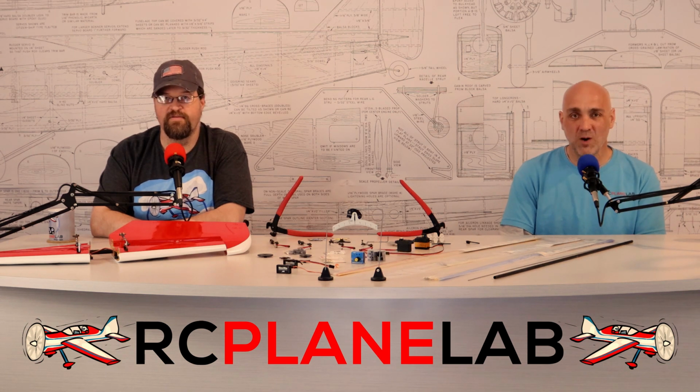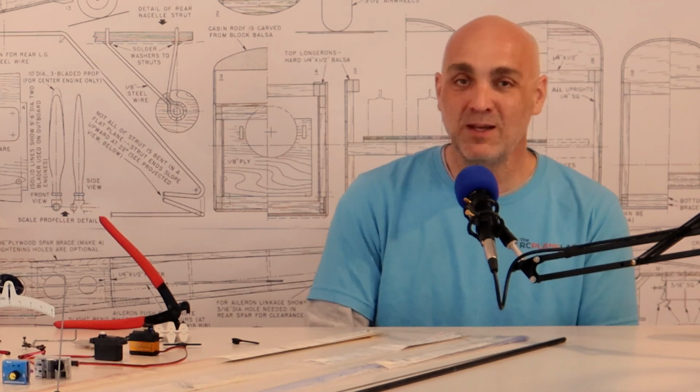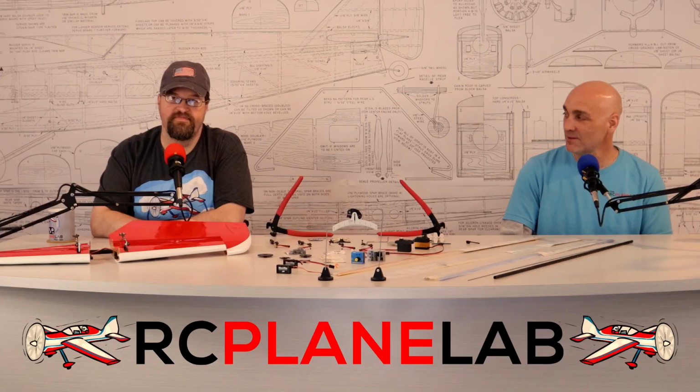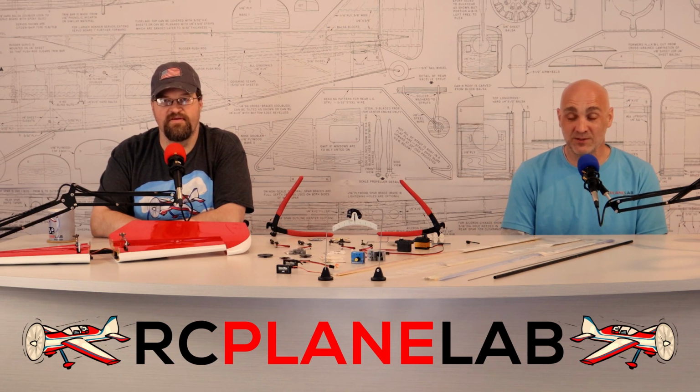Snug. And it wobbles. And that causes inconsistencies, especially if you're using it for throttle. You may have 10, 15 degrees of stick deflection on your throttle and you'll get no movement at your throttle because all that movement is being taken up by the slop in that pin in the hole. That drives me nuts. I can understand that. Okay, so that's one of the other reasons I don't like them.